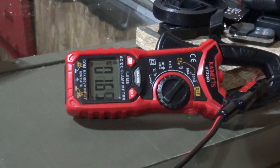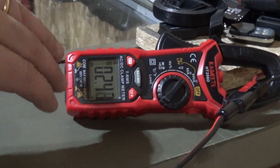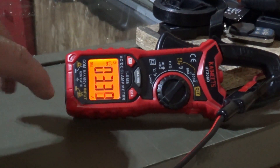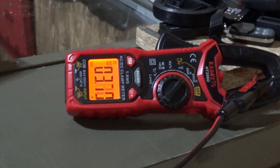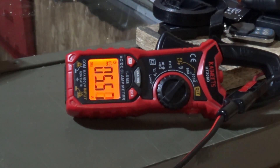I'm going to hit the off switch. You'll hear that the fuel pump stopped and the fan is still going, blowing over the burn chamber. There's still some warm air coming out — the burn chamber is still warm from running earlier. You're going to see power consumption go up as this turns off; the fan's going to kick on higher. I think the glow plug comes on as it turns off — that would really be the only reason we start drawing more power. I think that's the glow plug turning on to burn off any excess that's in the burn chamber.